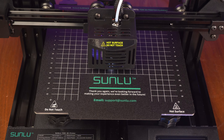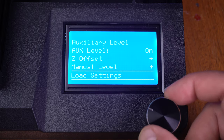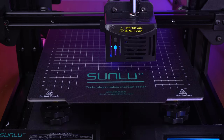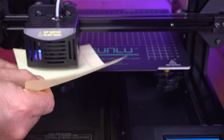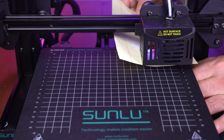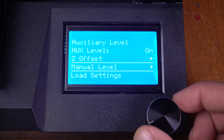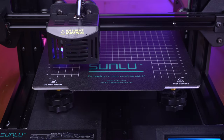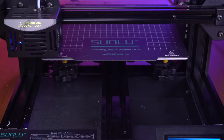Even though this has automatic bed leveling, right out of the box you really want to check the Z level height and do some manual leveling before letting it do its automatic thing — you never know how things shift during shipping. Grab a piece of paper and go to Level, then scroll down to manual level. It homes X, Y, and Z, then you go to each corner and do the standard leveling using the knobs below. Keep hitting next until you scroll through and hit done. Then go to auxiliary level — which is kind of misleading because it's auto level — and it goes through all its points check pretty fast.